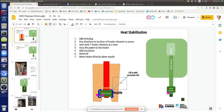Yeah, I think I'll put the thermistor below and above it, so I have a good gauge of what's the max temperature that the band heater is exerting and the minimum below. Thermistor inside aluminum foil? Yeah, but above, not to the side of it. Because putting the thermistor right on the heating element, I don't think it's a fair reading of how the pipe is doing. So it's the temperature of the pipe. Like above there? Yeah, precisely. And probably under the foil as well.